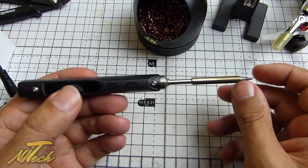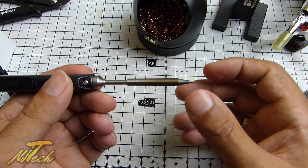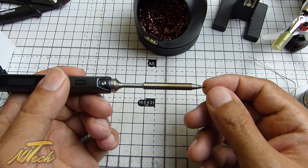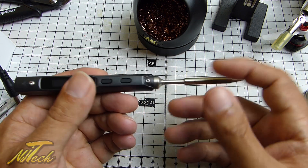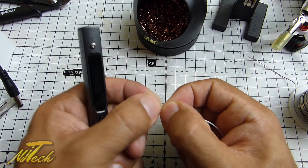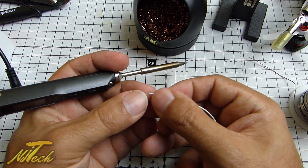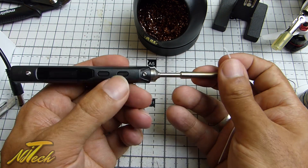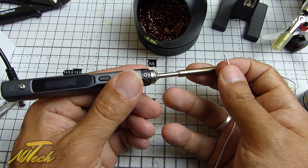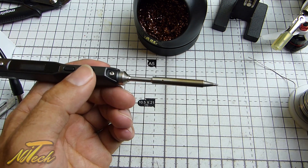It's got incredibly good temperature control giving you very precise temperatures. For example, if you're doing ground pads on PDBs you might want to work anywhere between 350 and 400 degrees to get a good flowing solder on big thick 12 gauge wires. But with ESC wires — which for some reason still come wrapped in plastic insulation that melts so easily — you can run it down at like 220 to 250 degrees, just enough for the solder to flow without melting the plastic. No melted plastic on the ESC signal wires, a good solder join, and then you can ramp it straight up to 400 for your ground wires.